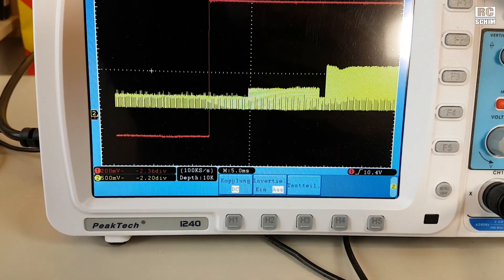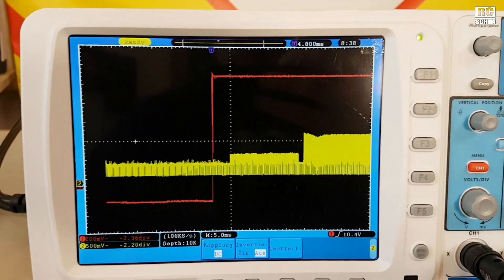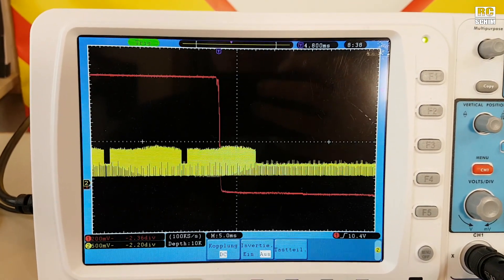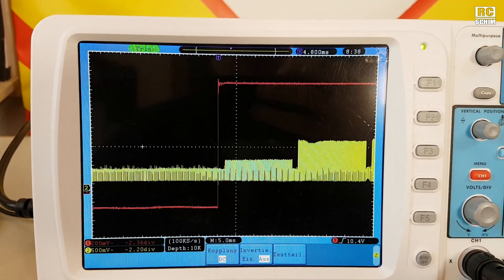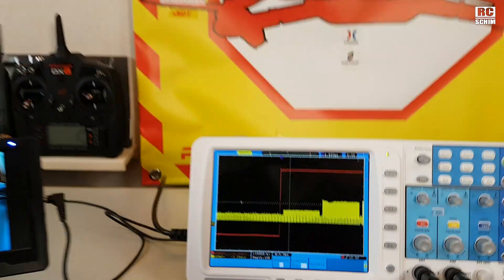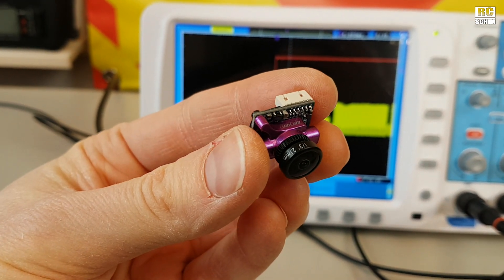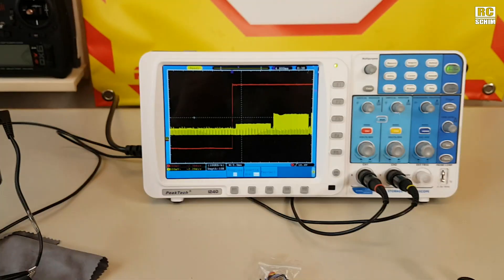I don't want to say those cams are slower, but on the video-out cable they show the result only in full frames — that's a funny conclusion to have. Until now I thought all cams would work the same, but CCD and CMOS seem to work differently. In fact, CMOS cams are easier to determine latency for me now because they always start at the same line. I hope this wasn't too complicated. I also discovered the two differences between global shutter CMOS and CCDs.